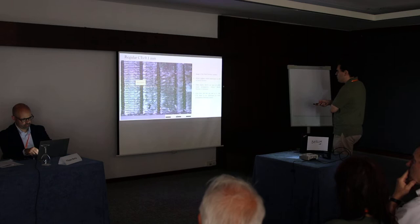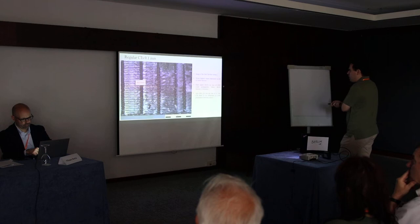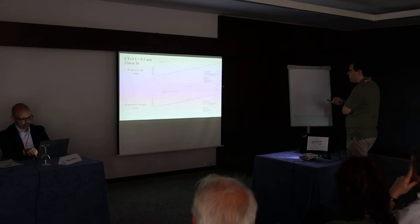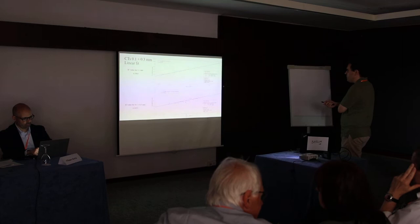And here is the image of crack propagation. It's in a darker area, showing that there was some ductile deformation. And with 0.1 specimens, we see quite an improvement in data consistency. So here the R-square value is close to 0.6, but still insufficient, really. Here is the crack growth kinetic chart of this one.